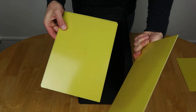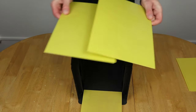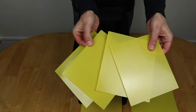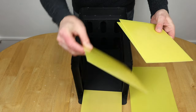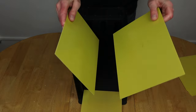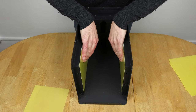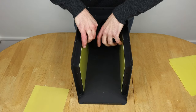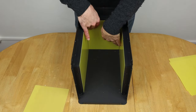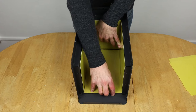Time to get the epoxy protection boards in. They come in different sizes — one thinner one for the bottom, two for the sides, four to go between the individual cells, and one for the front. From experience it's usually better to put the side and back ones in first, then put the bottom one in last. These aren't self-adhesive like the 48-volt battery box ones, so I'm doing a hand-holding exercise. They all fit perfectly.